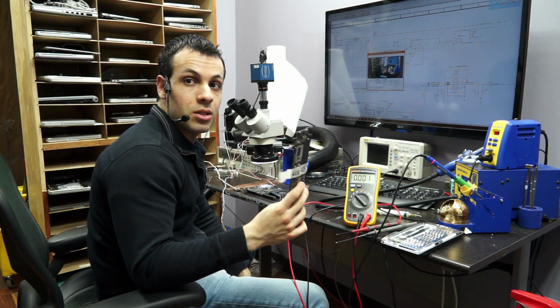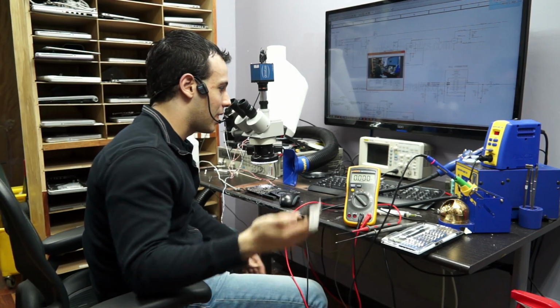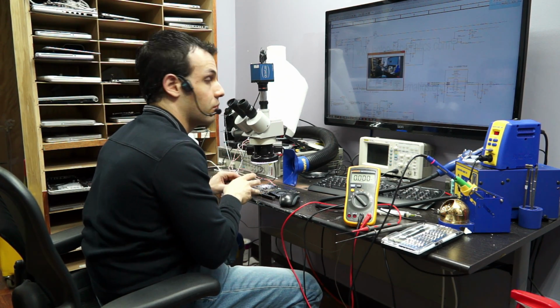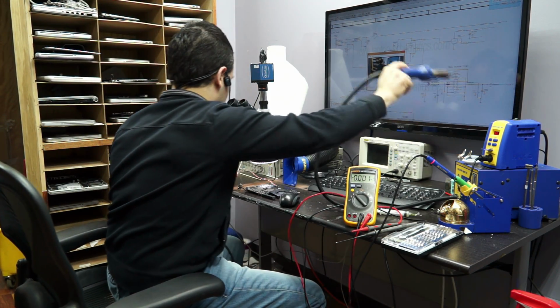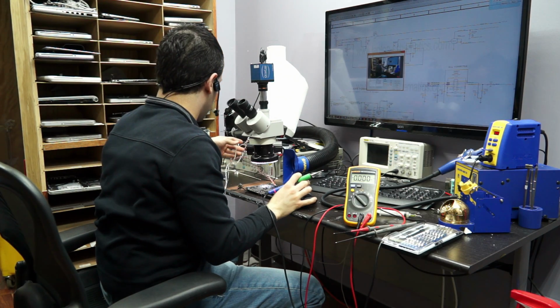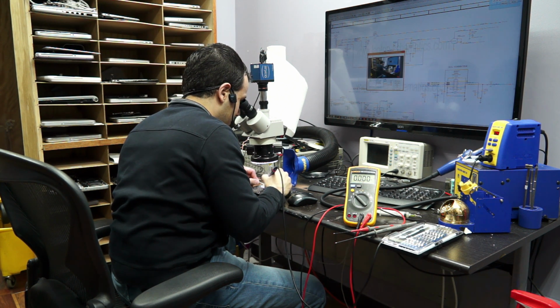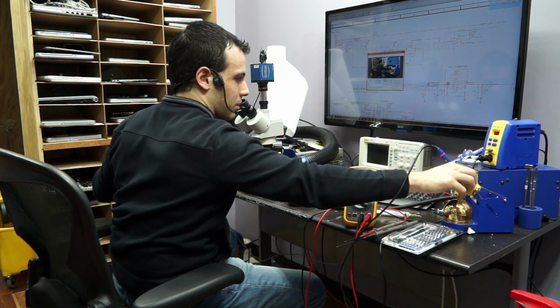Now this board was thrown in the garbage. This board is probably thrown in the garbage because it doesn't work, and there is a very, very good chance that this board didn't work because the SMC was bad. So you do all that work, and you're not even 100% sure if the SMC is causing the board issue. Let's face it, sometimes you could be wrong with the board level diagnosis. And then you are forced to test your theory using a part that you don't even know if it's good, using a process that is miserable and very prone to issues and failure. If you want to talk about not wanting to get involved in miserable nightmares and rabbit holes, the SMC is pretty much at the top of that list. That's why those go to the bottom of the pile. I mean, real, legitimate bottom of the pile.